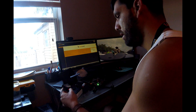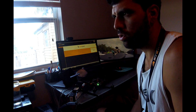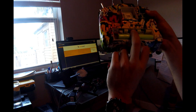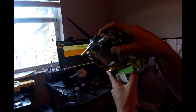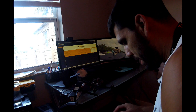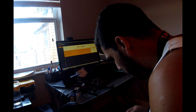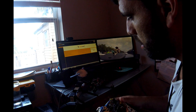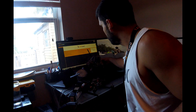Hopefully this has been helpful, guys. Just make sure you add the firmware to your remote control SD card - it's basically just like any other SD card, inside your remote where the battery goes. You can see there's a little SD card in there. Take the battery out and remove it by pushing in and it'll slide right out, just like your Fatshark DVR memory card. Save the new firmware for the XM Plus - I'll put it in the description of this video - save it onto the memory card, and follow the steps you just saw and you'll have OSD. Thanks for watching, and stay tuned for the next one. Sign up for RacingDroneRepairs.com if you want to start making some money fixing drones. Hashtag drone money.